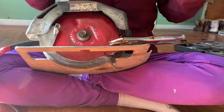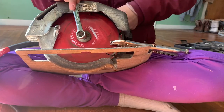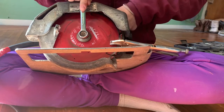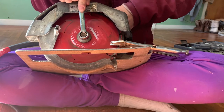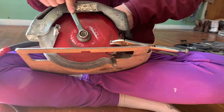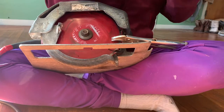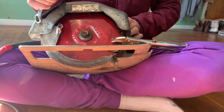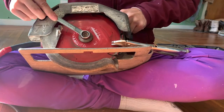Let me undo this — I'm having trouble even undoing the bolt from the washer itself because it had some grip and it's tight. I've got my finger in the spot where the worm drive mechanism is connected to the rest of the circular saw and this is working. But if that didn't work, I ended up taking an allen wrench from my toolbox and sticking that into this worm drive part, holding that down in place.